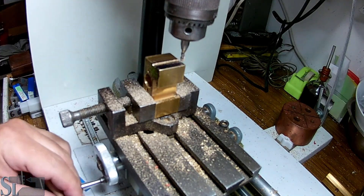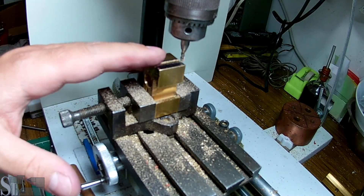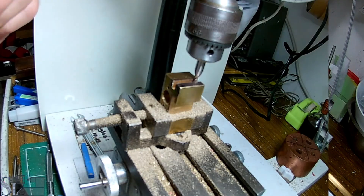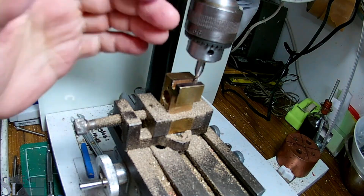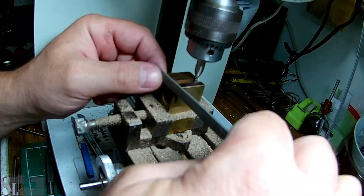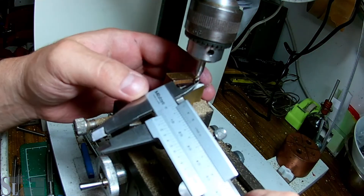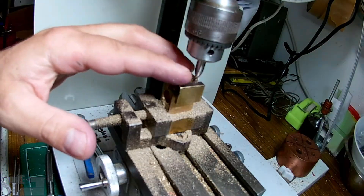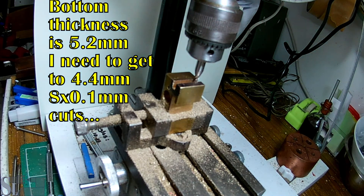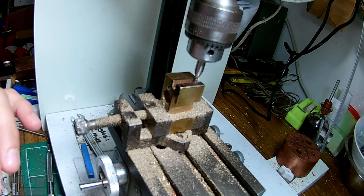That went a little bit easier. Bear in mind I have five millimeters to take, so it's 25 passes and then we'll do the edges. We have a 5.2 millimeter groove. We're at 5.2, we need to get to 4.4 — that's rather easy, we're going to take 0.1 millimeter steps one at a time.